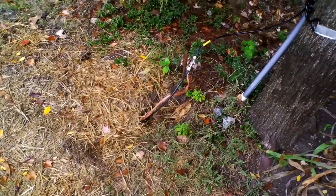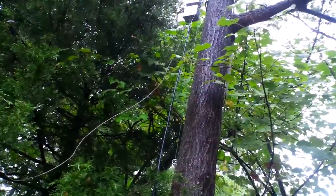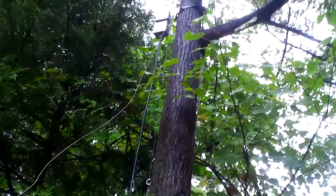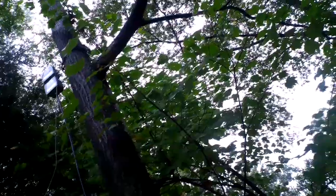And this is the station, well, not the station ground, but the end fed ground. And I have another lightning arrester right here. And it's going up to a 1-to-1 common mode filter, then to a 49-to-1. Let's get it reviewed. Hard to see in this teeny little picture here. There we are. Then we have a 49-to-1, I think they're called ununs, which matches 50 ohms to the high impedance that is at the ends of any dipole. You can feed a dipole at any point if you know what the impedance would be on the appropriate frequency, and then you would develop a transformer to do 50 ohms to wherever that is, but nobody does it except in specific points because it's just too many calculations.